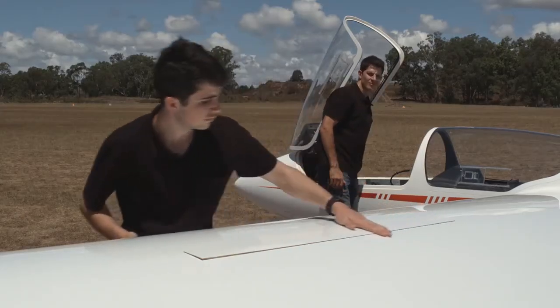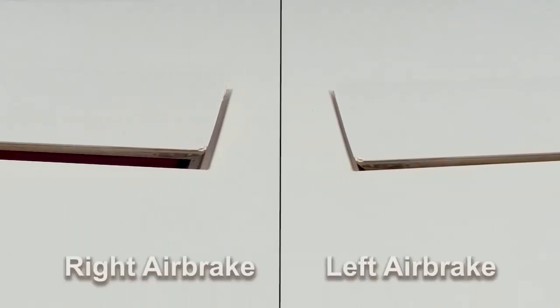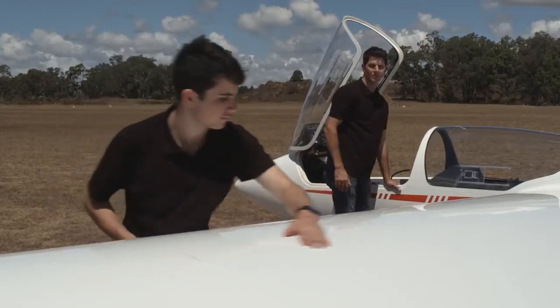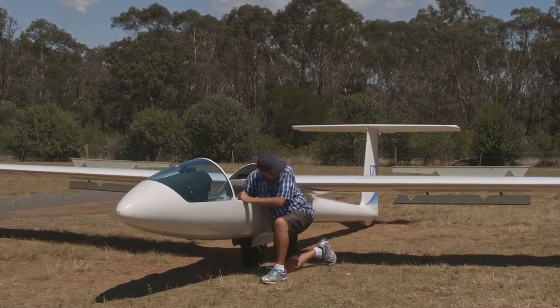Close but not lock the air brakes, and make sure they sit reasonably flush with the surface. They should sit out a little bit, but very uneven amounts of protuberance should be investigated further. Finally, lock the air brakes and make sure the caps pull down tight against the surface. And don't forget the ones on the bottom surface too, for those gliders that have them.